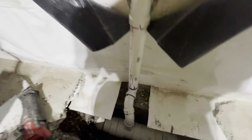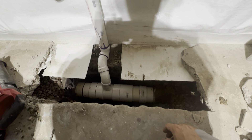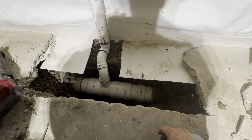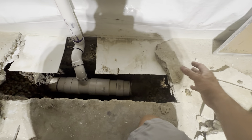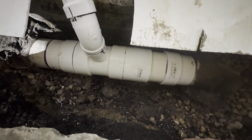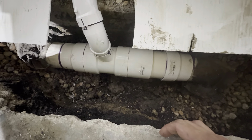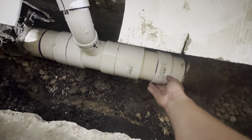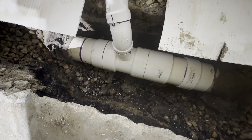After drilling, I hammered up the concrete on the perimeter — this sump system was installed as a retrofit on this old house from the 20s or 30s, so it didn't originally have one. You just hammer it up with the jackhammer and then dig down around this drain pipe, probably about 12 to 18 inches deep. It was a real challenge to dig in this constrained space, and the dirt underneath was just clay, so it was really difficult to get the clay out from underneath.